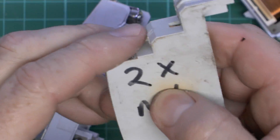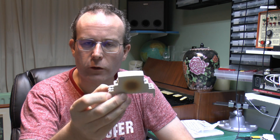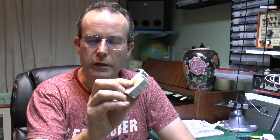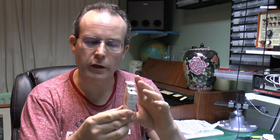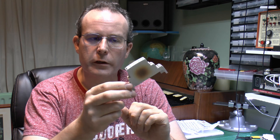Not totally clear what actually broke there, because it seems the only thing that holds it in place is the spring, and there's a little impression pressed in the middle of the contact so that it holds it laterally between the two. But as you saw, that's obviously slipped aside and therefore doesn't work anymore. The overheating thing again is not good, but bearing in mind these have been in use for 15 years, it's generally not a big disaster. One thing you can do if you're going to fit contactors expected to be powered up for extended periods is to put a blank module next to each one in the rack rather than putting them all next to each other, so you get more airflow around the actual body. That may be something to consider if installing them in places where they're going to be powered on for many hours at a time. But anyway, that's after 15 years, so not entirely unexpected. So that's it for this time — until next time, thanks for watching.